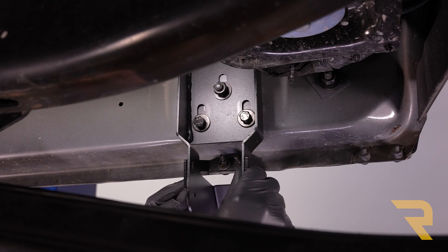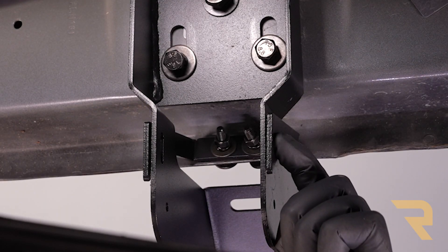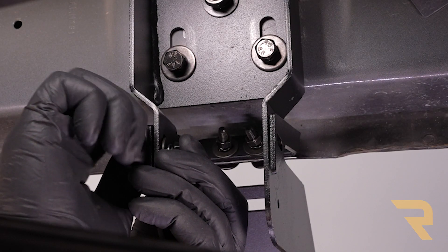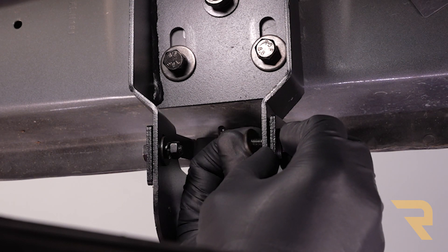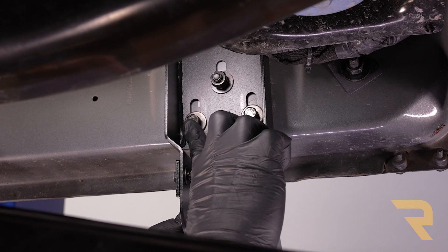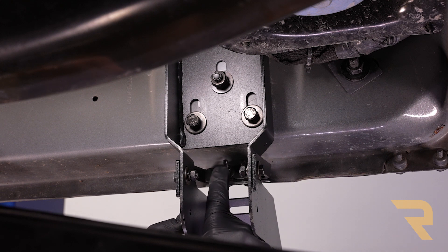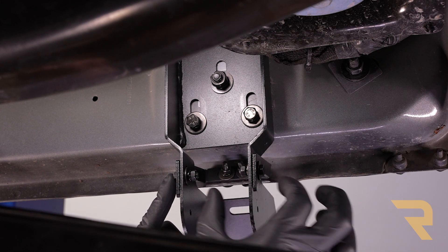Next, what we want to do is go ahead and lift our bracket up and also lift our support braces up through the holes in the side of the support brace in the bracket. We're going to use our smaller 6-millimeter bolt with washer, and then on each side do flat washer, lock washer, and nut. Do the same thing on this side as well. Now while I'm holding the bracket up, we're going to tighten down these two bolts using a 13-millimeter and this one using a 15-millimeter. Then we can come back and tighten down this hardware using a 10-millimeter on both sides. Once this is locked in, we can lock in this also using a 10-millimeter on both sides.